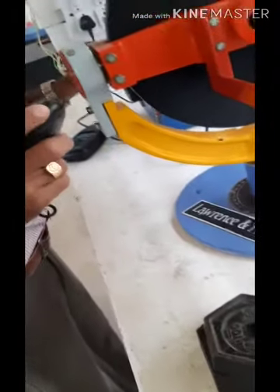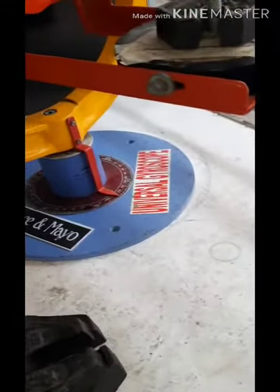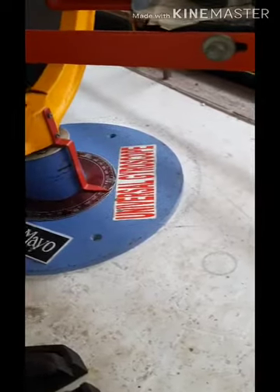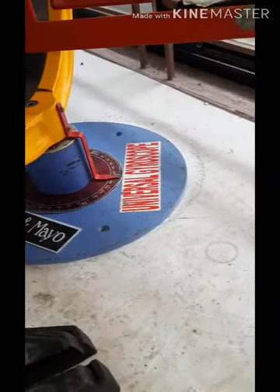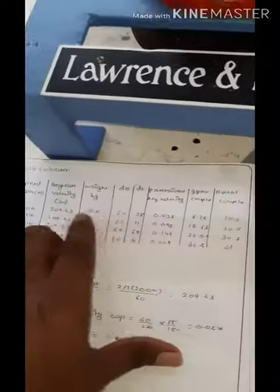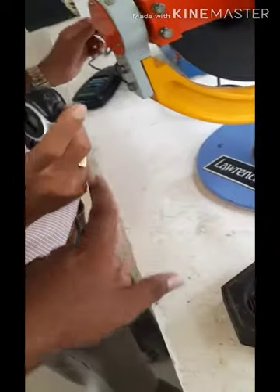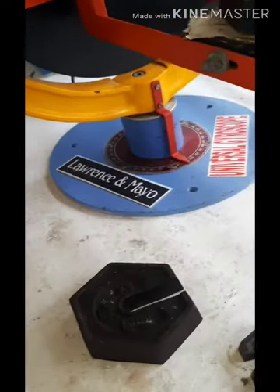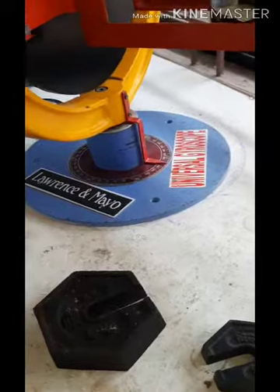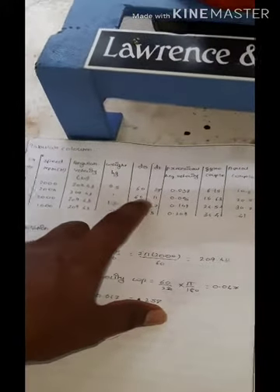The disc is turning. For 60 degrees of rotation — that is from 0° to 300° on the scale — we stop and record. For 0.5 kg, the time taken for 60 degrees rotation is 28 seconds. Now add a weight of 1 kg and for the same 60 degrees rotation, note the time taken. For 1 kg, the time taken is 11 seconds.